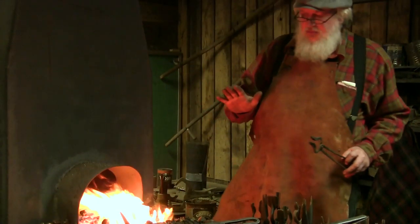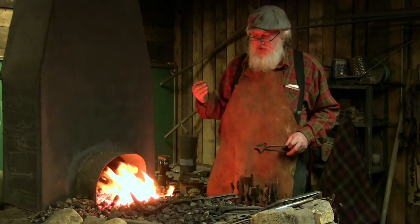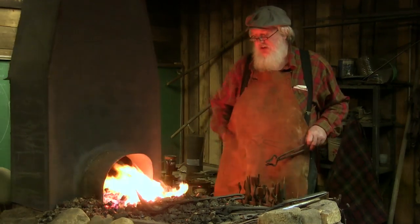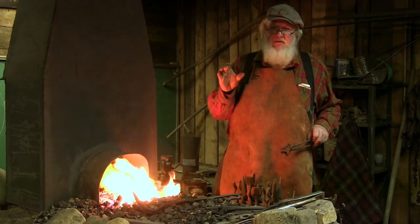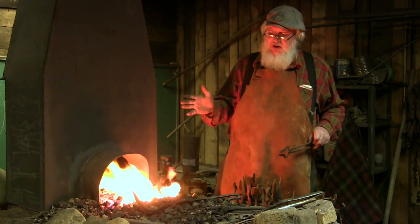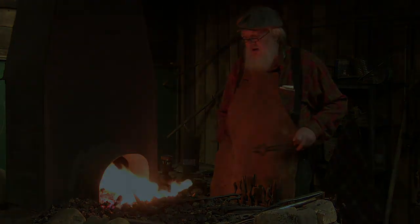It's important working with high carbon steel — you never want to quench it, because the minute you quench it, it becomes really hard and really brittle. It's also a good idea, when you're doing high carbon steel, to have a wider bit than you're going to require for the finished product, so that if you do get it too hot and lose a little bit of integrity, it's very easy to trim it down.